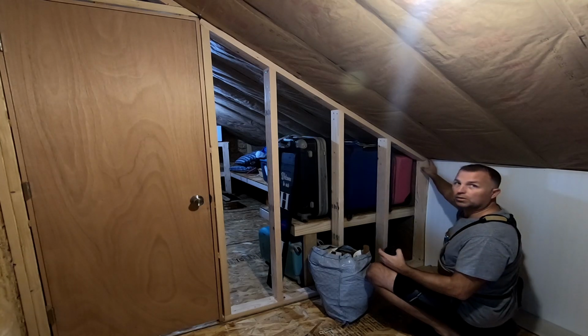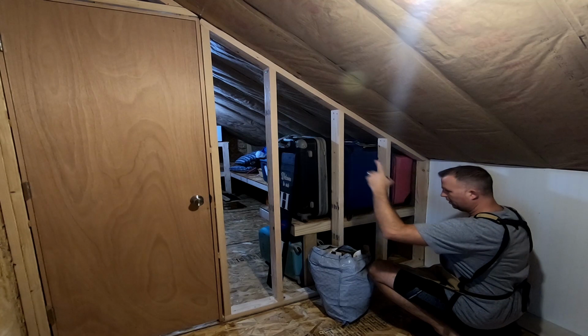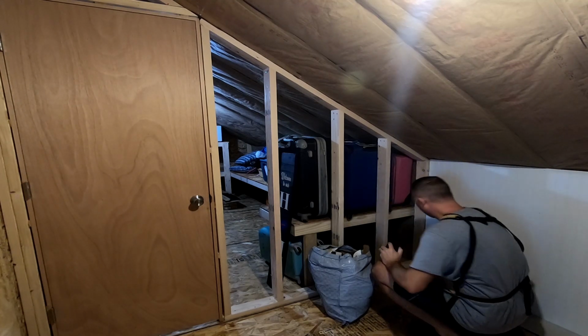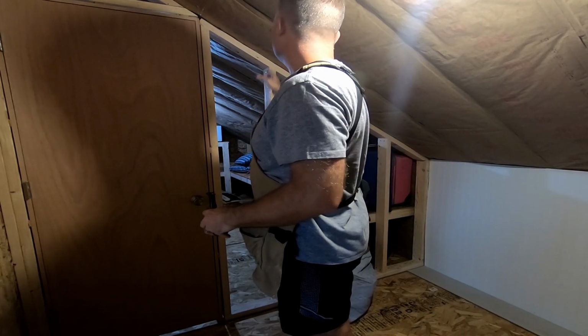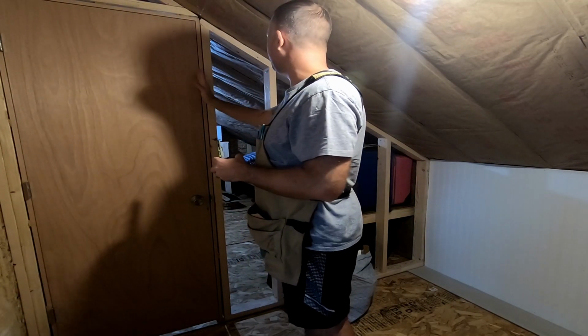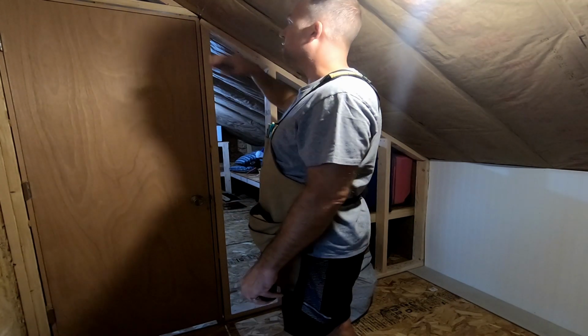And then we'll go downstairs and we'll mark out 44 at this end, 73.5 at that end. And I'll show you how we put down the straight edge and just cut a nice piece there. So this will be one piece, and this piece will be a little trickier. We've got to cut it around the door here. So I'll take more measurements of these points, how wide this is right here, and then that little section over there. And then we'll cut this.